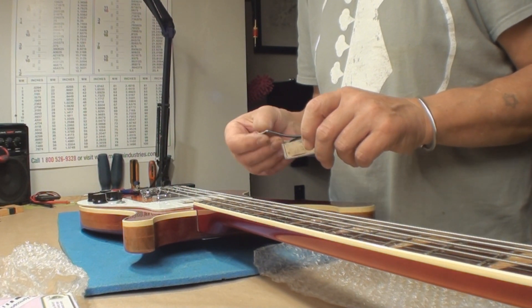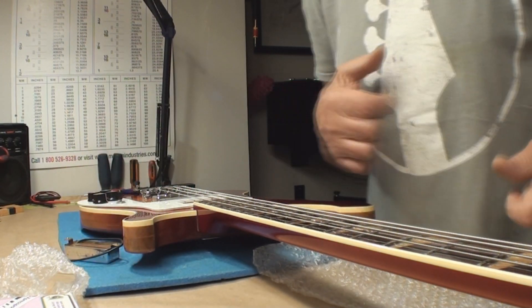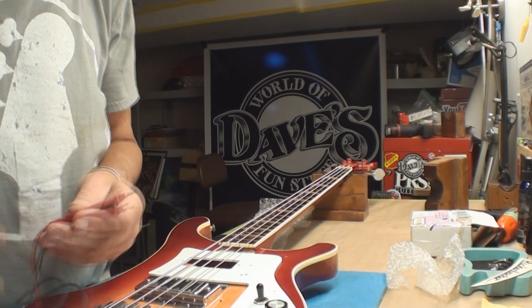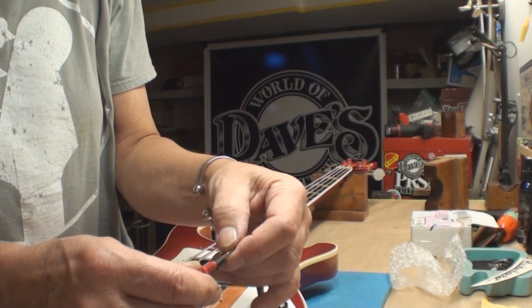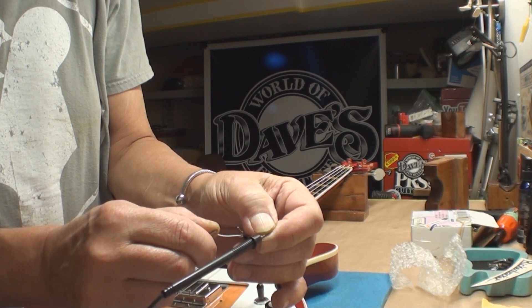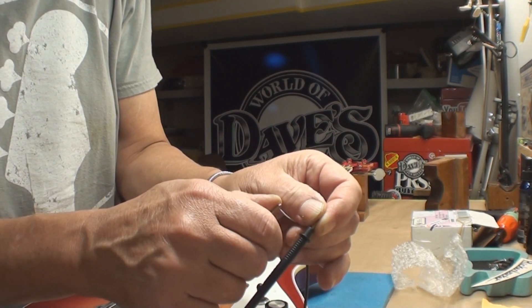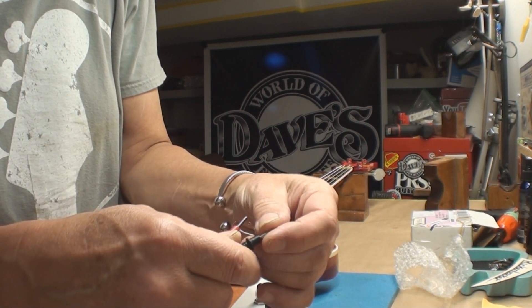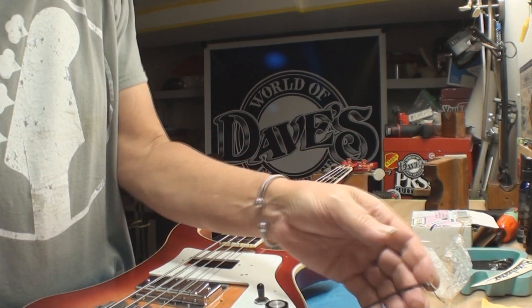Other than a bunch of extraneous shipping costs, we seem to have a rewound pickup in question — rewound once anyway. The Pickup Wizard got her back fast as snot both times. We're just going to measure the impedance to see if the Pickup Wizard actually succeeded. What we'd like to see is a resistance of 8.5k ohms across those coils — and right now, look at that: 8.52k ohms. And if we do a continuity check, because it is a coil it should be through — fantastic.